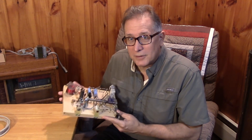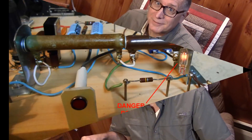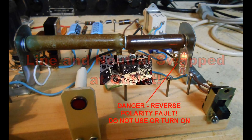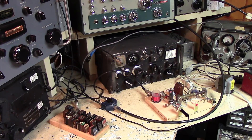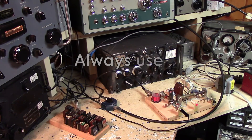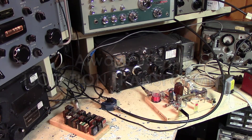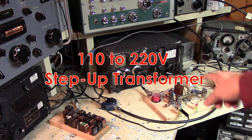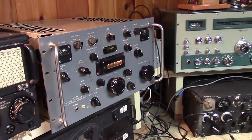Let's get into the Widowmaker transmitter and some of the safety features on board. Tonight we're looking at a QRP station. This is a Widowmaker transmitter — one that runs directly off the line with no transformer. In this case, I am using a transformer right here. The transmitter has a single tube, a 50C5, written up in Elementary Electronics back in the 60s — a one-tube off-the-line transmitter. It uses crystal control, we're on 40 meters, and we're going to use the R390 receiver.